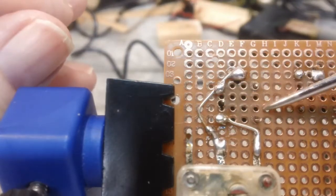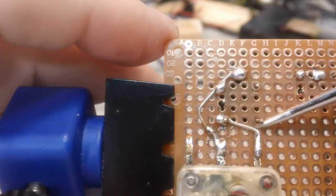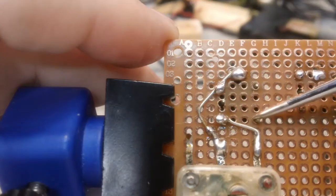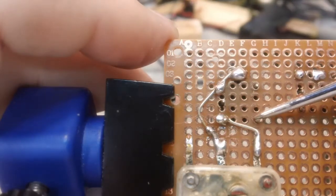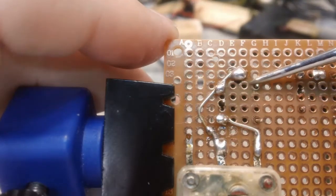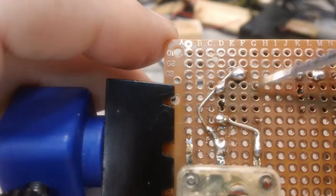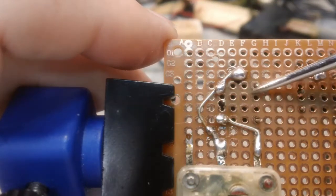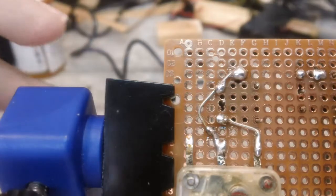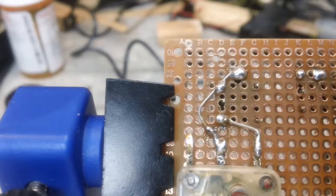That was pretty easy to do, I think. Now the two secondary, one goes to a 1 microfarad capacitor to ground, and the other one goes to a V plus, or V battery, whatever you want to call that. I don't know if I've probably gone backwards, but in fact I think I did. But anyway, that's what each one of them goes to. So that's where we're headed with that. But these are just connections that don't require any components right now.